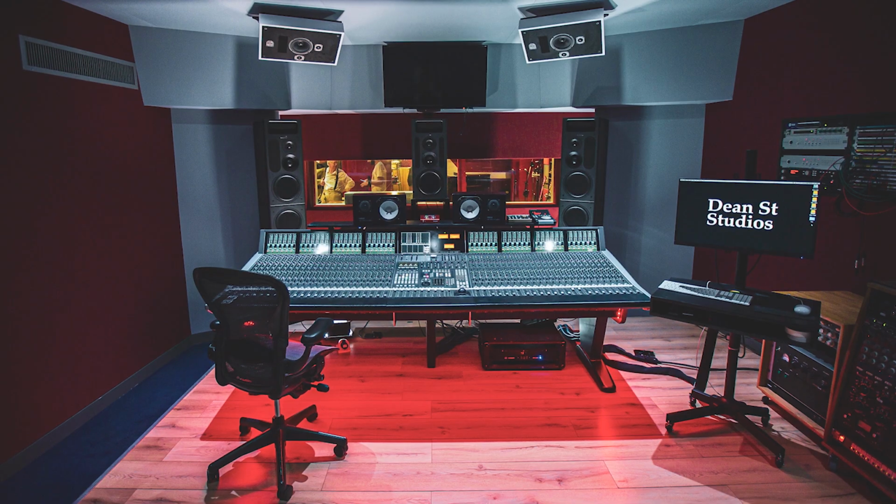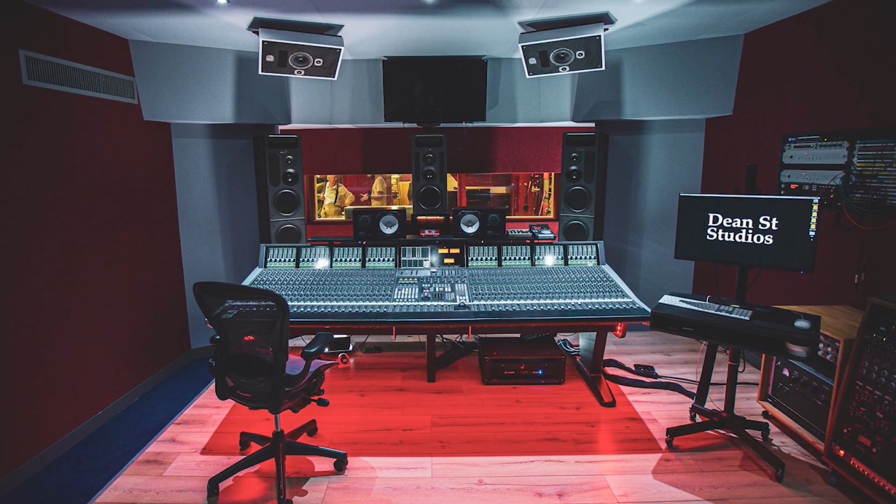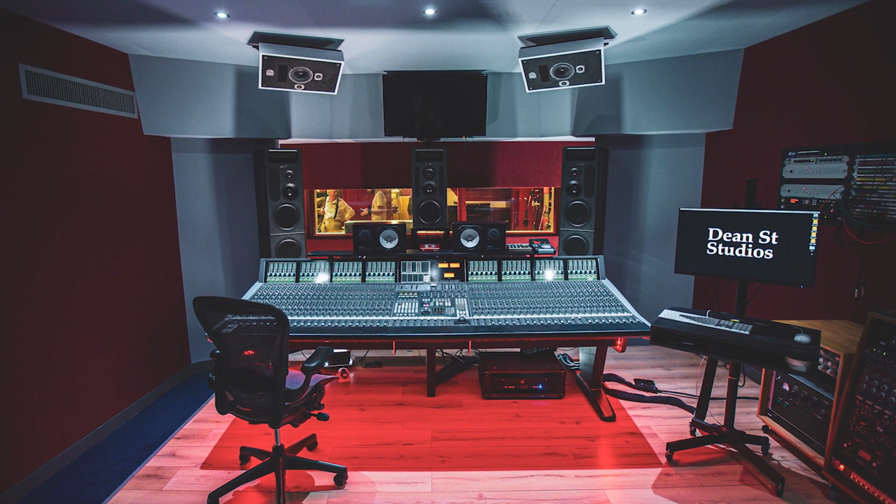I ask people to follow the recommended speaker placements in the best practices document available at professionalsupport.dolby.com. It may seem obvious, but we ask people to aim the speakers at the mix position. And when you aim your speakers, aim them in an over-the-shoulder style that allows for a wider sweet spot.